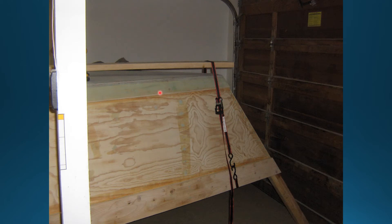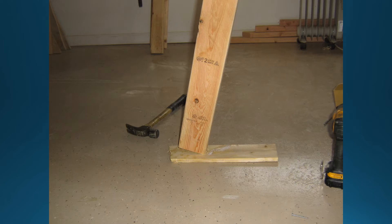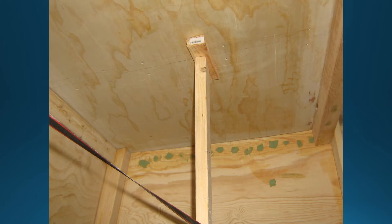I then used a ratchet strap to bend the 2x6 slowly around the bottom until it touched the bow right here. I also used a ratchet strap between the frames. Notice the use of scrap blocks — these increase the clamping pressure. You may see gaps even with the blocks and the strap pretty tight. Notice right here there is a gap in this aft frame. The way I handled any remaining gap was to climb under the boat and wedge a 2x4 between the floor and the bottom of the boat.